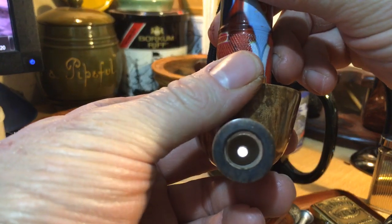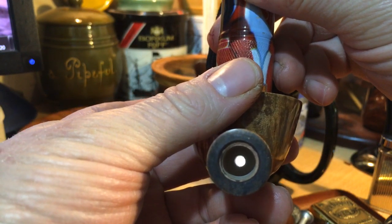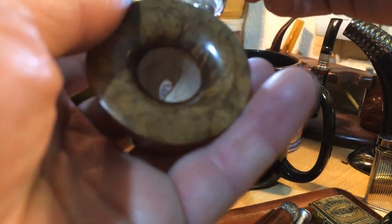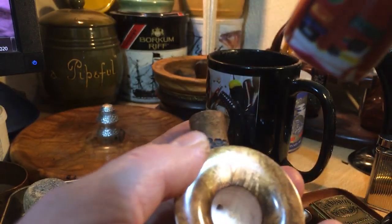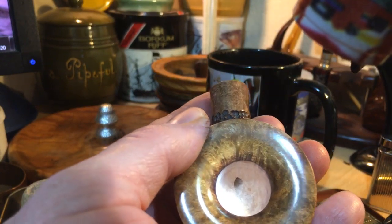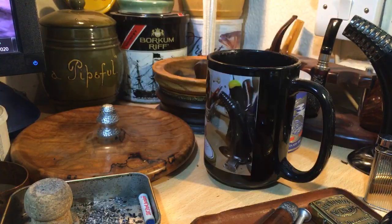That one there you can see is perfectly circular, absolutely bang in the middle, and it's really no challenge if you're doing it on a lathe. It's nothing special. That one there, you see that one has come out absolutely perfectly, and when you get that inverted teardrop shape, you've done it well. When you get a complete circle, that usually means you're maybe slightly off.